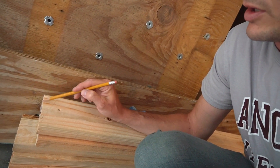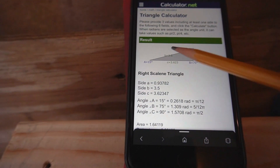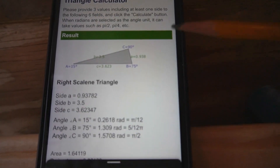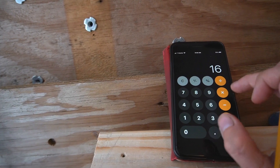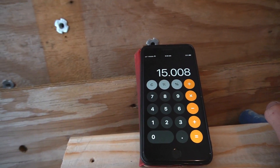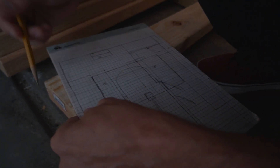So by taking trigonometry, we can take the length of this side and this known angle and find this length here. We've done the triangle calculator math with our 15-degree angle, 90-degree known angle, and our known distance of three and a half inches. It gives us 0.938 — just shy of an inch. Since an inch is divided into sixteenths, 16 times 0.938 equals 15 sixteenths. So it's going to be 15 sixteenths of an inch from here to here to equal that 15-degree angle.